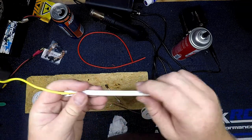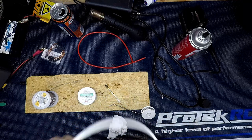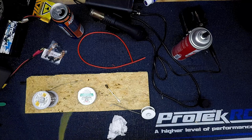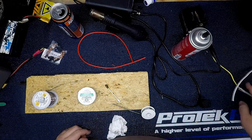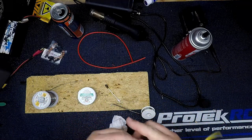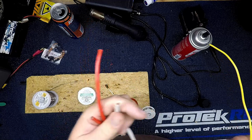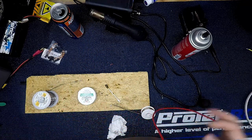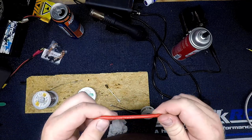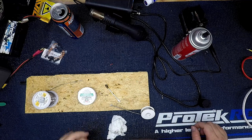Marine grade is the highest quality you can get — it's designed to resist corrosion. If you're somewhere where your electronics are known for corrosion or you have a lot of rust, maybe look into marine grade wire. I buy wire from West Marine — it comes with two 10-gauge wires, red and black or red and yellow. Check the C rating on any wire you're going to solder to make sure it will handle the heat.